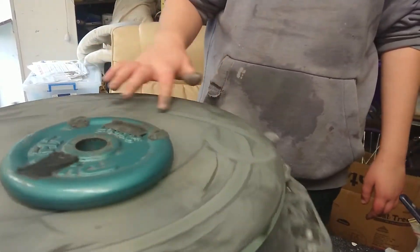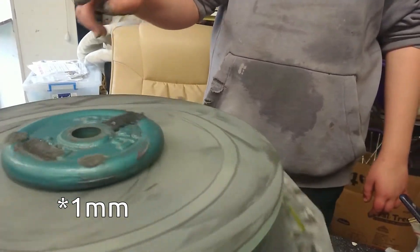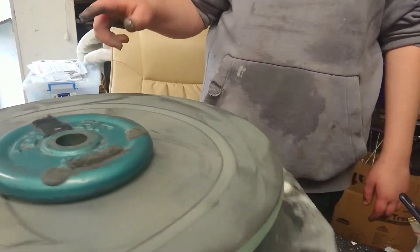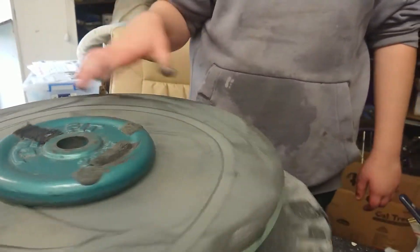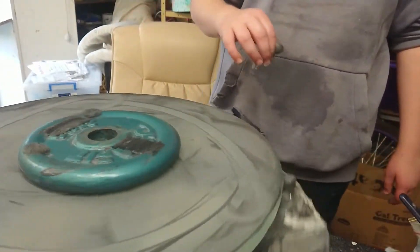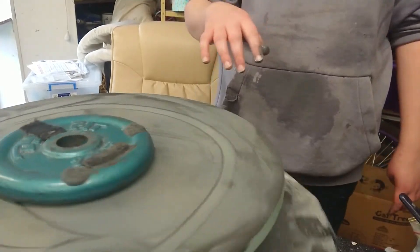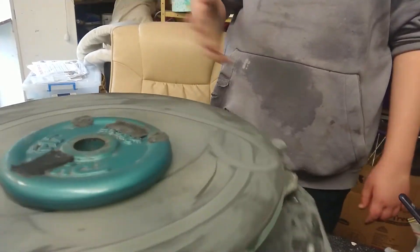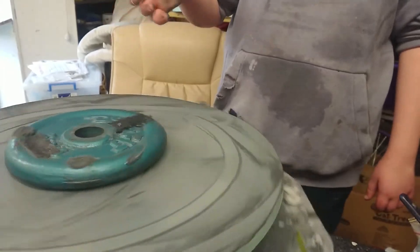I have about another 5mm of sagitta to go until I reach 8.3mm of sagitta, and then I can begin fine grinding. First I need to grind it to spherical because the ring tool takes a divot out of the centre. Then I'll use 80 or 120 grit — I'm running low on 80 — then 240, 25 micron, 9 micron, and then start polishing.